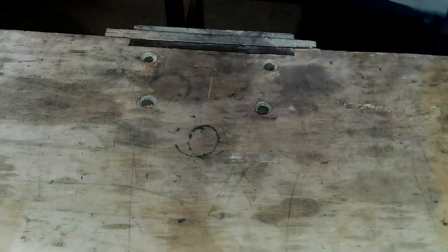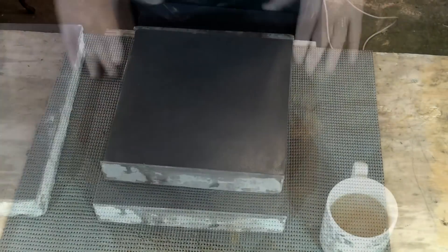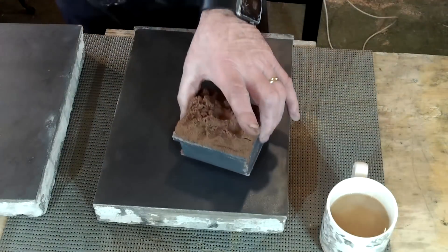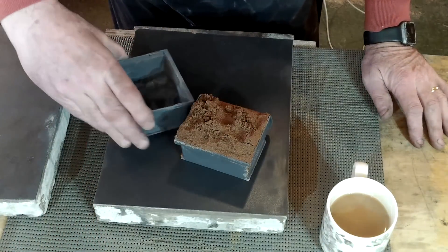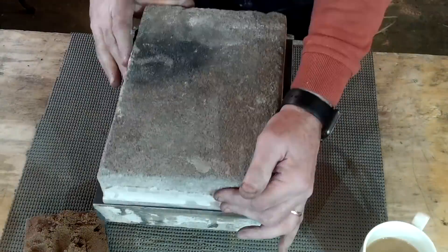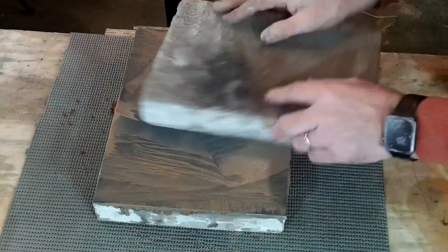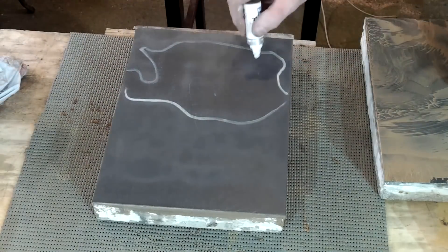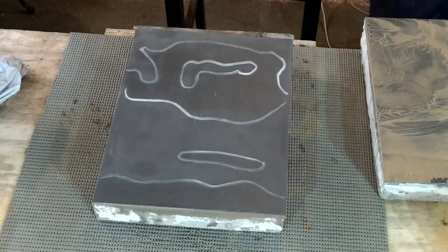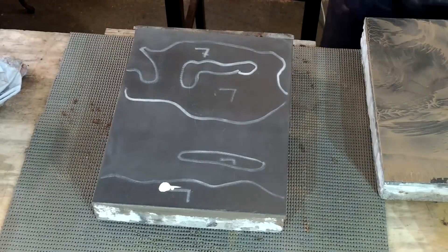Before I attach the marble tiles to the other side of these concrete slabs, I'm going to roughly hone each of these tiles against each other to remove the majority of the irregularities. The reason I'm doing this now is because floor tiles are very hard and it will take some doing to get them to wear each other flat. The grinding medium I'm going to use is very coarse building sand and the slightly finer material I've collected from underneath the grinder. It may be contaminated with steel, iron and possibly coffee grinds, but for now it doesn't really matter.